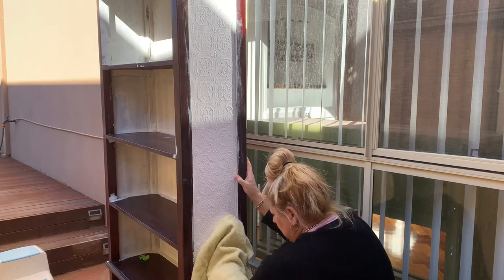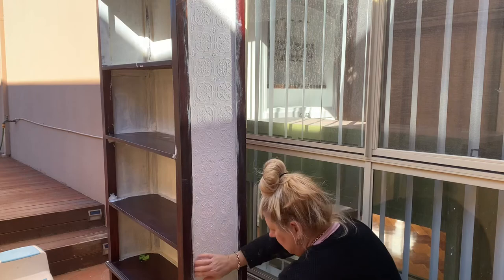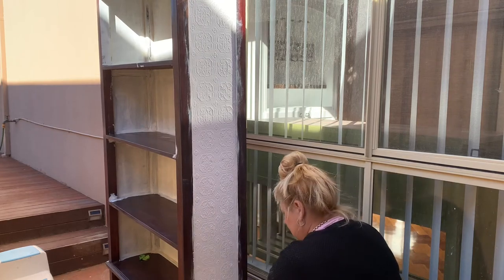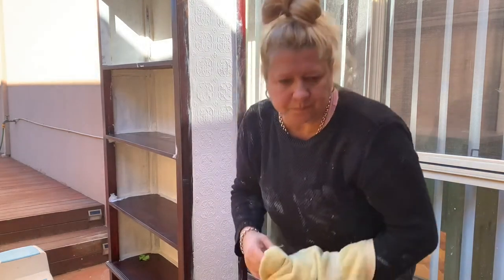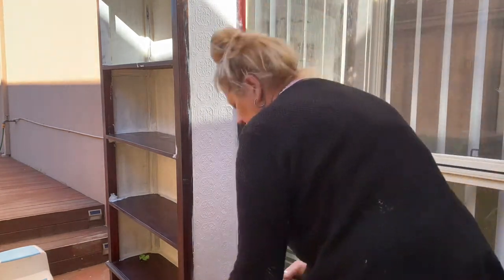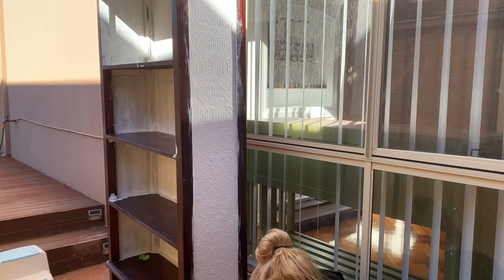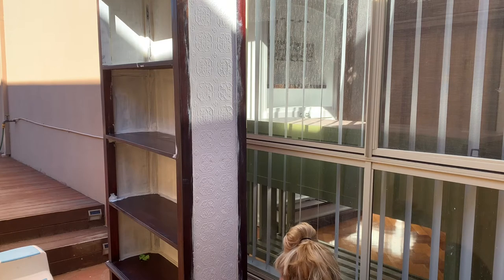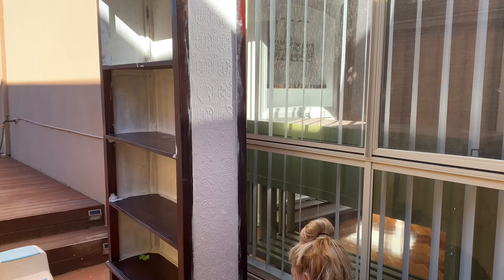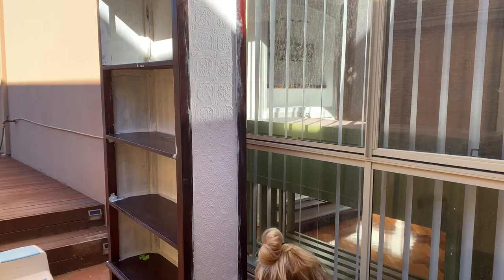What I'm trying to do is keep the right hand side with more paste, because what I'm now going to do is I'm going to trim. So, how I trim? Use a blunt knife. I just go in the corner, into the crack, and I just get the crease, and then we pull it off. And you can see we've got a nice line there that we're just going to cut.